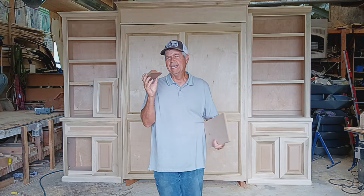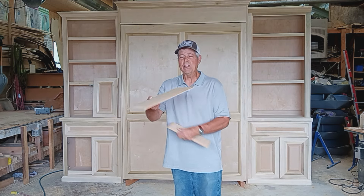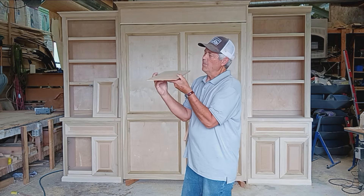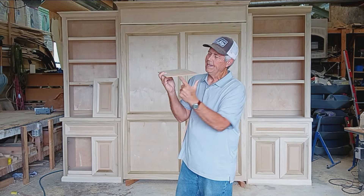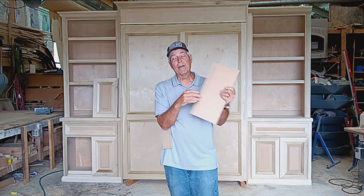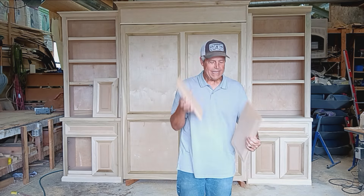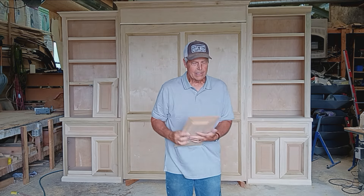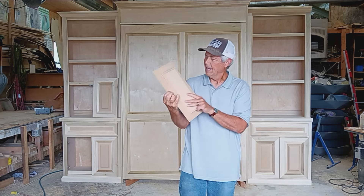A lot of times, instead of full three-quarters, you use 11/16 MDF for raised panels. But again, you've got a big shoulder there. What I did was take a piece of half-inch material and run it so that I didn't get any shoulder — I just got that bevel. That got me to the point where I could add the other profile.